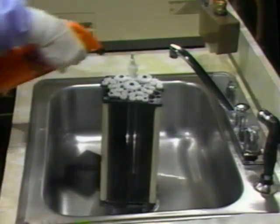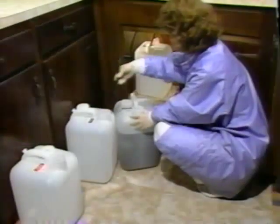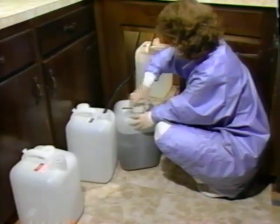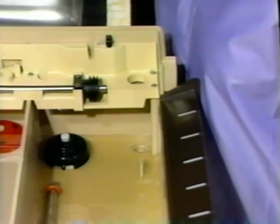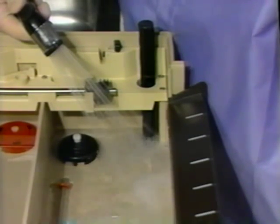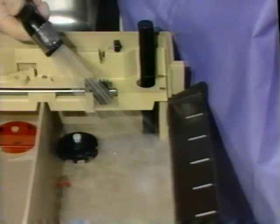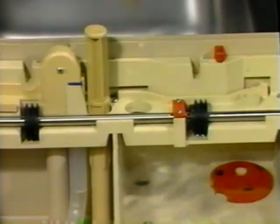If you need to review the rack cleaning procedure, rewind this tape and review the weekly cleaning section or refer to your manual. The most important part of changing chemistry is to drain and rinse several times. Be sure when draining into recovery containers that they won't overflow. First, unscrew and remove the developer drain tube, letting the tank drain completely. Replace the drain tube, fill with water, and repeat this procedure of drain, fill, drain three more times. Now use a sponge to rid the tank of any residue. Fill and drain again to rinse the tank. Follow this same procedure for the fixer tank and then for the wash tank.